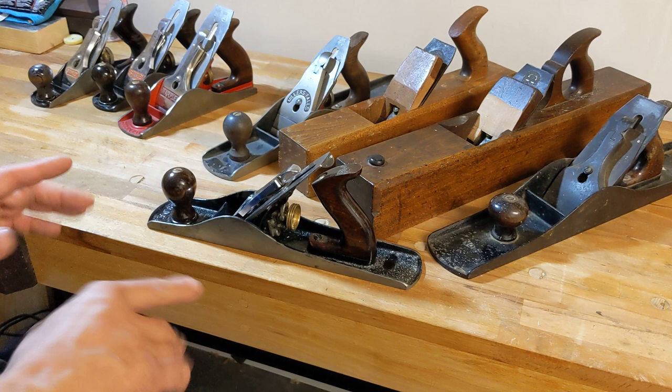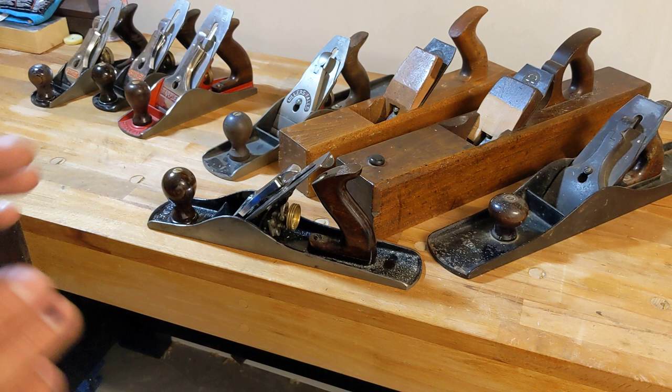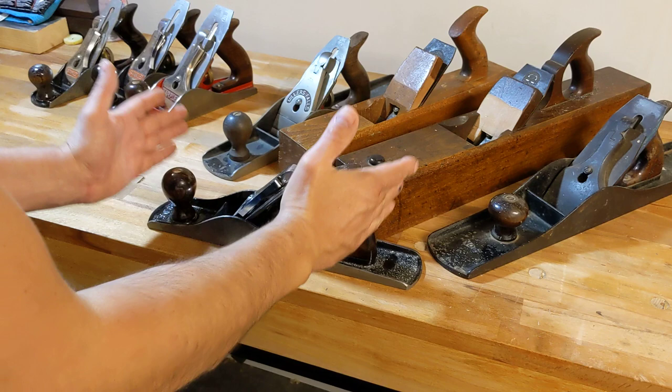In my experience, bevel ups, they do a good enough job, but they were a quirky plane made by Stanley. And Stanley could have cured the cracked mouth problem that they had on them if they wanted to. They just weren't that great a plane. For whatever reason, and I've got my suspicions because they seem less complicated, but they're more of a faff. It's just, that's a separate video, but stick with a number 5 next.